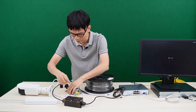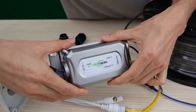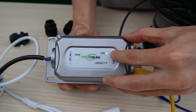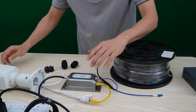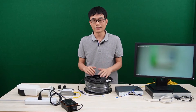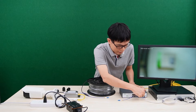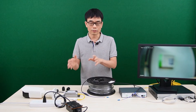This is the power adapter — an outdoor-type power adapter. I'm going to connect the power to this media converter and plug the power into the AC outlet. Once I plug the power, you can see the power indicator is on and the link indicator is on. That means we're getting power and data. It will take a while before we can see the live video on the monitor. The camera is live again. This is the setup — it's easy, with no need to configure anything. Remember, we still need the SFP transceiver because the SFP slot doesn't include that component, which converts the fiber optic signal to the electronic signal.